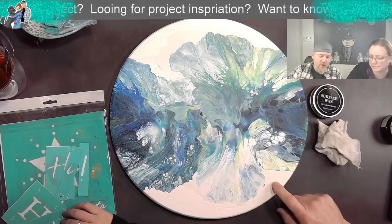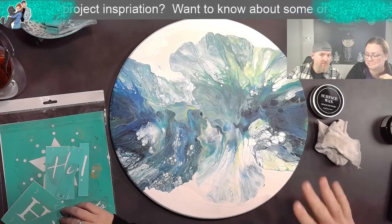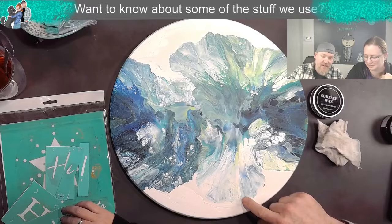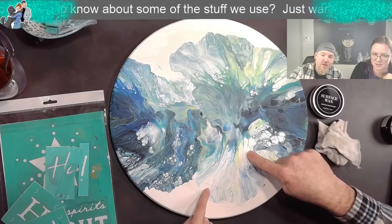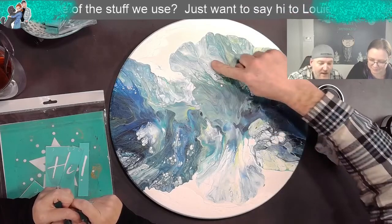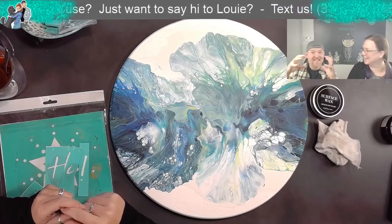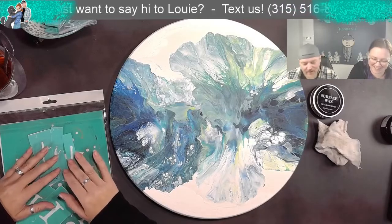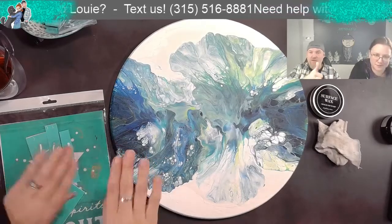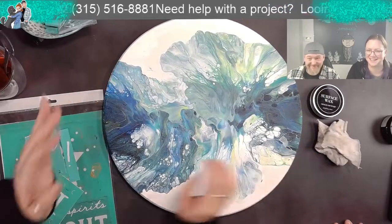One thing I will tell you: if you're going to use real wood - thicker, actual real wood, especially the stuff that's glued together - make sure you paint it first, a couple of coats. Seal it. Because there was so much moisture that the wood actually wicked the moisture out of the paint. There are little cracks right where the wood is bonded together - it started opening them up. There's also a black hole where there must have been a hole in the wood and it sucked all the paint in. The other pro tip about sealing is it keeps it from getting warped - this board is over an inch thick. So make sure you seal your stuff.